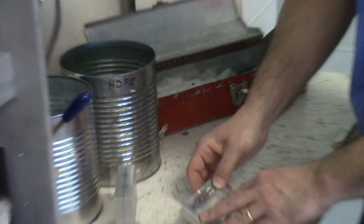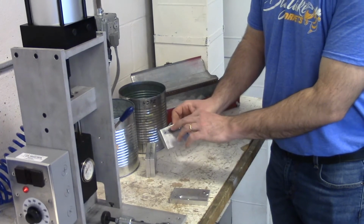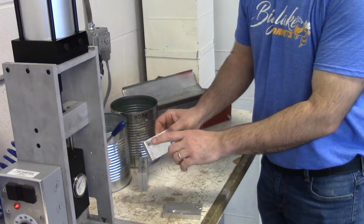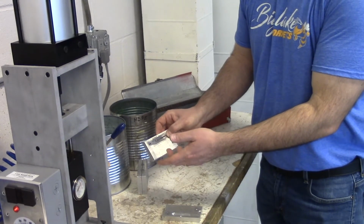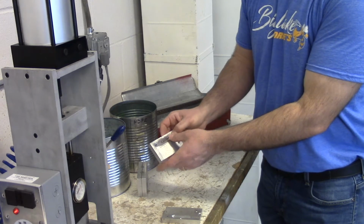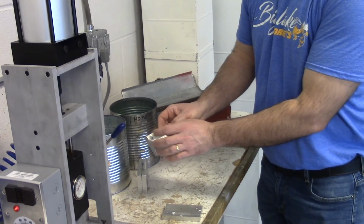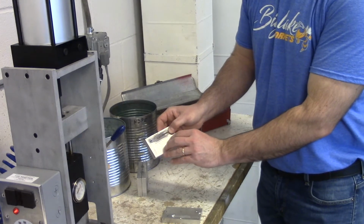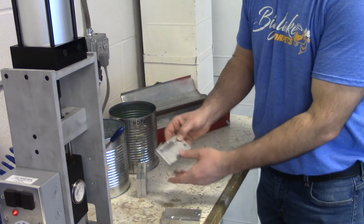In multiple cavity molds, the sprue would go off to two different runners, and those would go off to sub-runners, and we could make 6, 8, 12, maybe 24 pieces in one injection. So the runner system will split the sprue into different directions, and from each runner would be a gate to each individual mold cavity opening for each part.